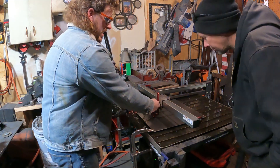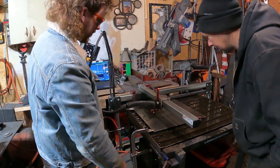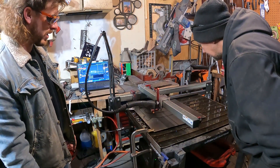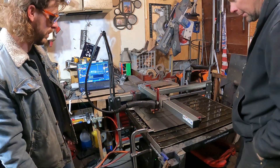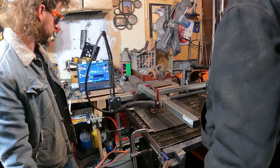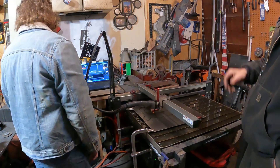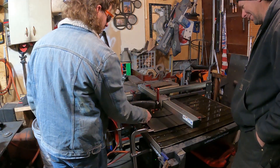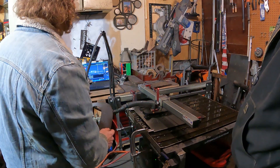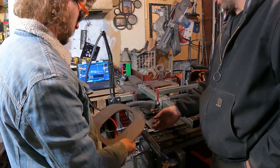Two things that aren't automated: I've got a Z-axis that's by hand — I have to adjust that before and after, using shims to set the torch height. The other thing that isn't automatic is amperage, so we'll check the backside of the cut to make sure it looks good. We did some test cutting before. The Q came out 12 by 12 — that was the font type we chose. It's not too bad, but I don't like that it doesn't look as nice. You're going to be seeing it from way far away — let me hold it up.